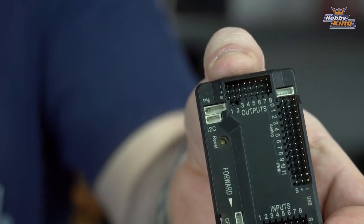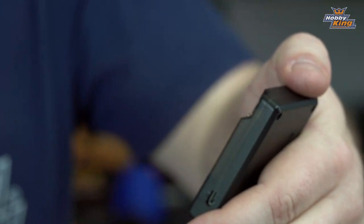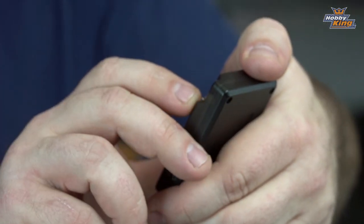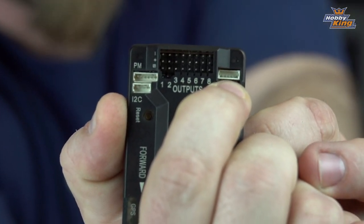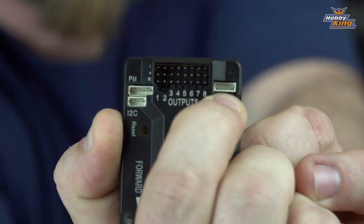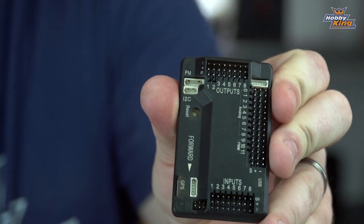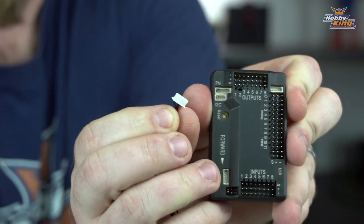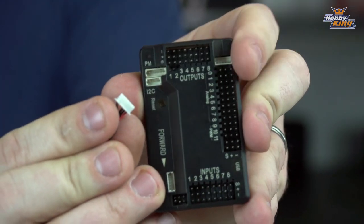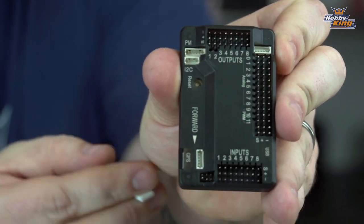The other unit that we were going to use is actually the hardest to locate. That's the 3DR radio option, or the two-way telemetry radio option. There's actually tiny lettering way down in that hole right there that says 3DR radio, which is the plug for your radio connector. For some reason you can't see that. I didn't even know it was there until I really looked at this thing the other day. The advantage being that it is actually the only plug on this board with the right number of pins for that connector. So you just match the number of pins on the connector to the right port on the board, that guy for the radio. That's all the functions we plugged in.